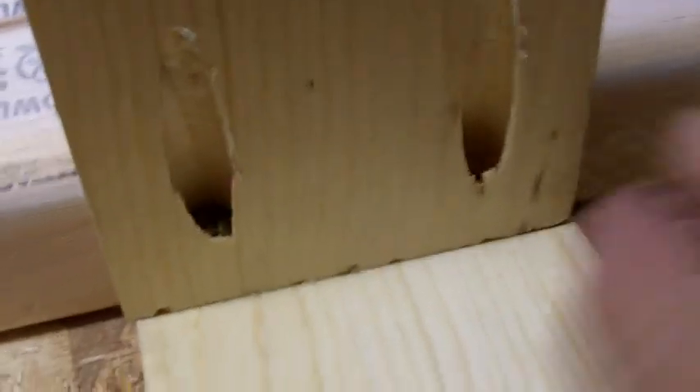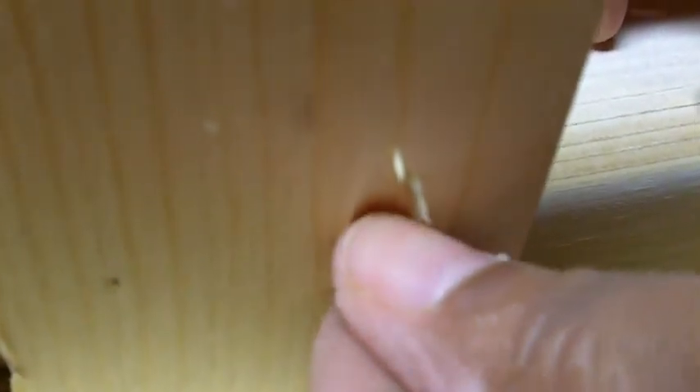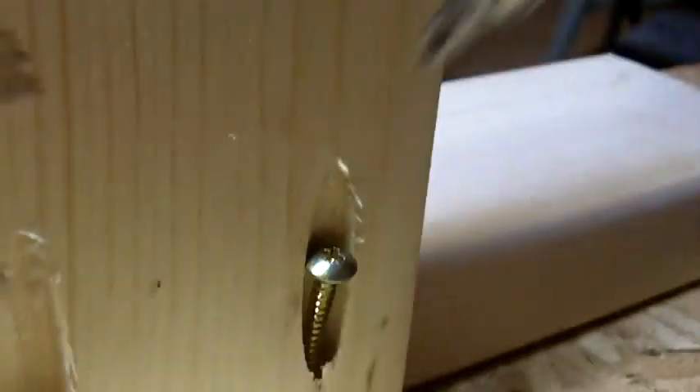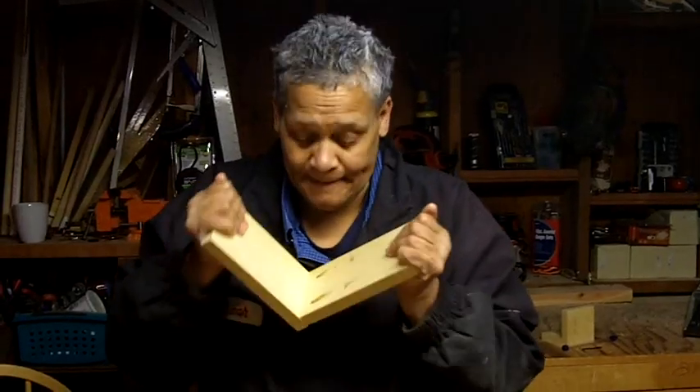Now I'm going to drive the second screw. Inside the pocket is the pilot hole — I insert the screw and drill it into place. And that's it. Look at that joint. I can't move it. It's not that complicated, and that's why it's so common in building furniture today — it just makes a superior joint. This is Leah saying you can do this. See you next time.